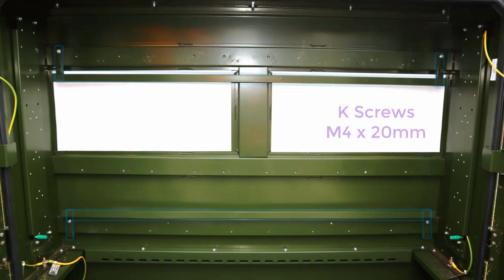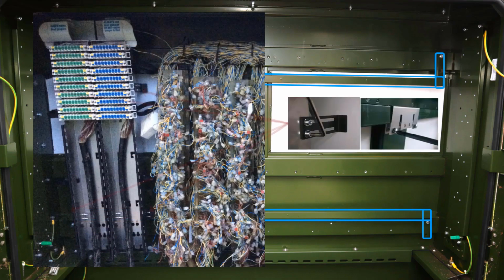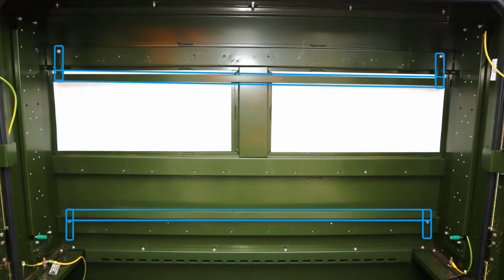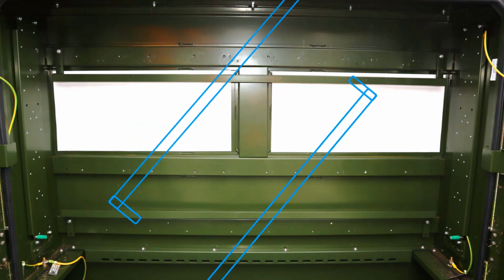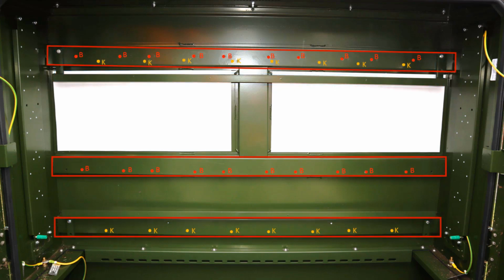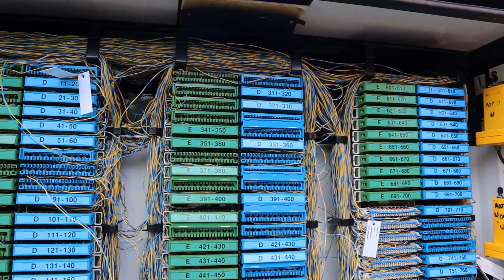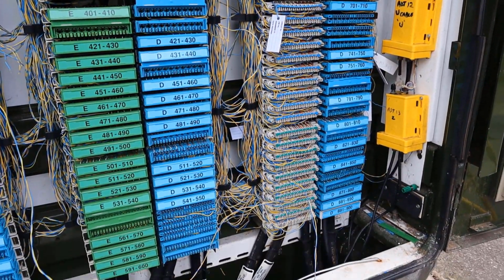Where a mixture of modular and strips cross connection systems are to be rehung, the mounting bars are to be used, and appropriate column fixing kits and jacking bolts and brackets must also be used. Again, the mounting bars can be turned 180 degrees. They can be moved to the up or down position. Now we have an understanding of where the different modular systems attach, let's have a look at releasing them.